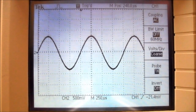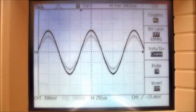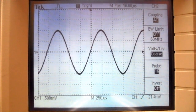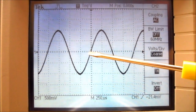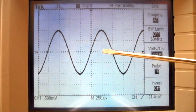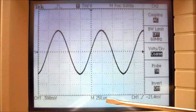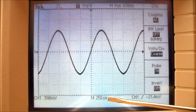I'm going to press the channel 1 menu button to bring back my main waveform, and press my channel 2 menu button. So I'm left with 1 waveform. I'm going to readjust the position so that the waveform goes right through the center of the zero lines. So it's gone through the center of my zero lines. The period covers 1 complete cycle. So this is considered 1 complete cycle. 1 complete cycle covers 1, 2, 3, 4 divisions. And we're on 250 microseconds. So the period is 4 times 250 microseconds, or 1 millisecond.